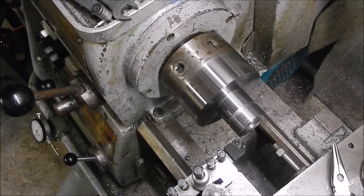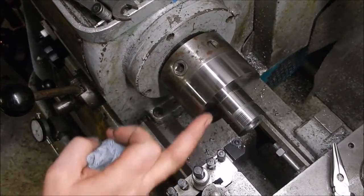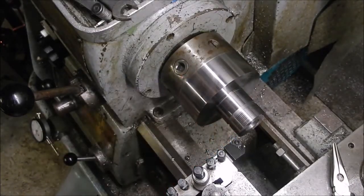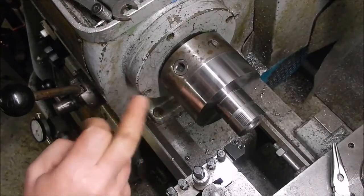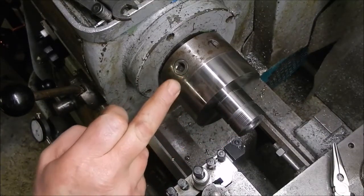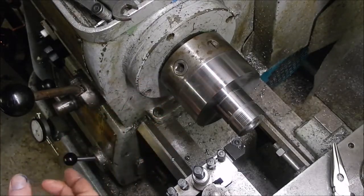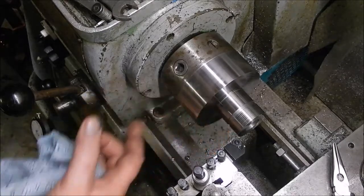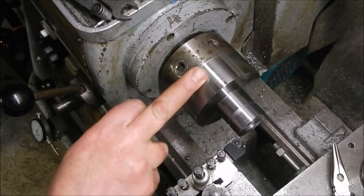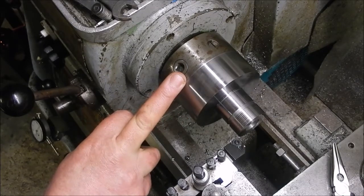Right, here we go again. This all machined out really well, to be honest. You know when you say it's alright but in the back of your mind you're not sure — what I did before I turned this, I took it off and took some more measurements. It was the taper; I'd got it just a tad too tight. So I put the four-jaw back on, reset it all up, trimmed it in, and I just took the finest of cuts and then it popped on a lot better.